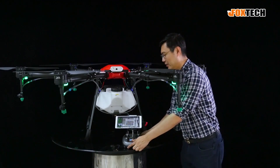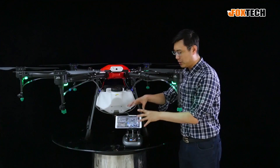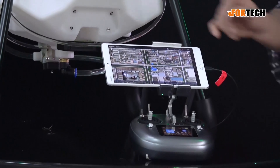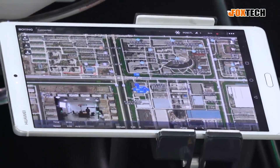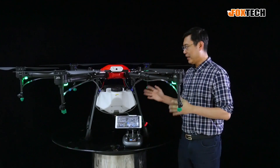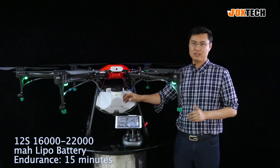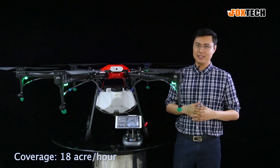You can always see the FPV video right here. If you want to go back to the map, the FPV video shrinks to a very small size and you can move it around so it's not blocking your view. We have quick functions like takeoff and landing, and many settings for different parameters — basically you just need speed, altitude, and flying time, that's enough. For the batteries, it can use 12S, 16,000 to 22,000 mAh batteries, with flying time up to 15 minutes while spraying a full 16-liter tank.